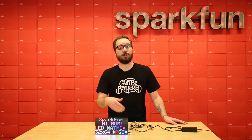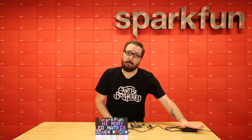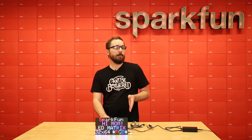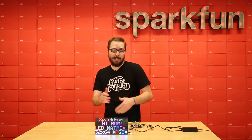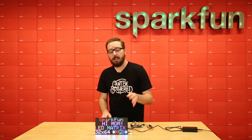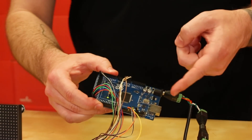We set up a simple example of the matrix to show off the color range of the LEDs as well as to frankly show you what it looks like while it's on. It's all powered with a basic 5 volt power supply running into an Arduino Mega. You are going to want to make sure that you use an Arduino Mega or equivalent, because unfortunately an Uno and the RedBoard will not be able to handle the computational power required for the matrix. In fact, SparkX is currently developing a Mega shield right now that will help you hook it up easier, so you don't have this rat's nest of cables.